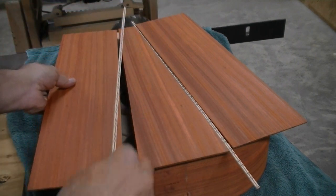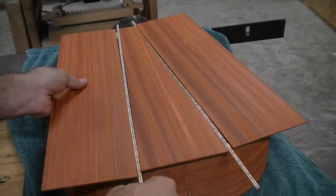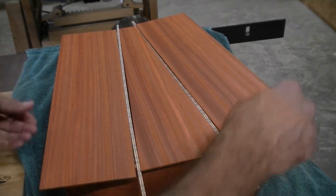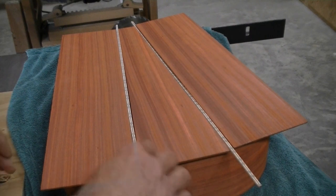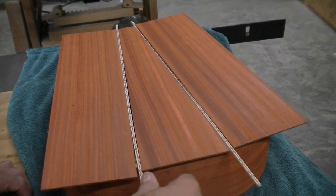The width of the wood would force me to make it three piece. There is no question about that. And it just is barely wide enough with these little extra filler strips to make it perfect. So that's going to work out good. You would have to put some kind of strip down through there anyway. It just doesn't look good when you don't put a strip in there. So anyway, we would do that. So I think we're going to lay it out and glue it up.